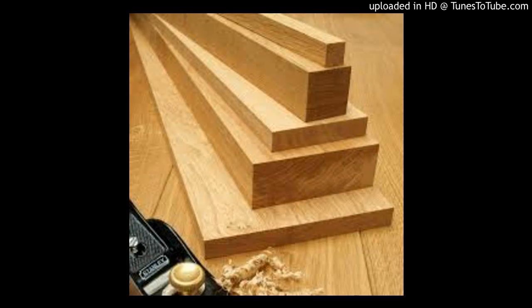We're aiming for this, using 2 joists and about 150mm between them. That allows you to get your end clearance and also a 5mm gap between the ends of the boards. That 5mm gap is very important because your uptake of moisture through the end grain is about 8 times faster than through the side grain. You've got to protect your end grain. And you can see there, and you've seen often enough, how when decking is just butted together, it decays. But very easy to solve.